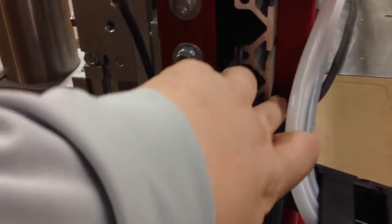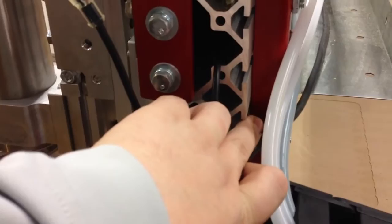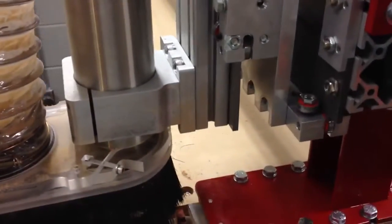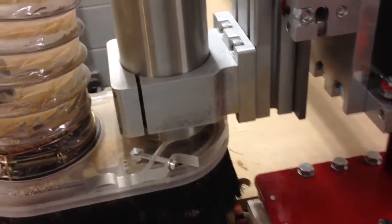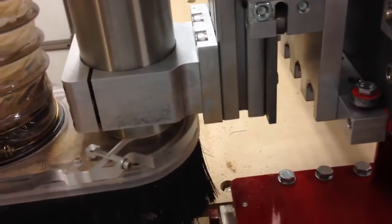There are a couple things I still need to do. I need to get a couple of precision shims and shim out the back on each side, which will help bring that two thousandths of an inch down to zero on each side. I also tried tramming the head — I got it trammed easily in one direction, but I need to shim out the bottom here to get it fully trammed. I think shimming it out might take care of that issue.